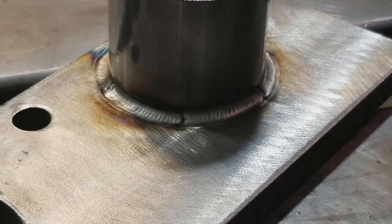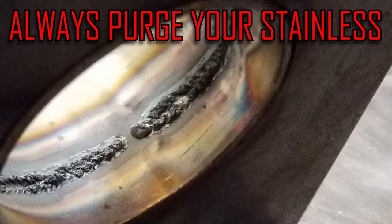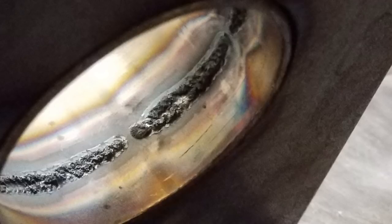This is stainless steel and I'll be perfectly honest — there's a reason I did not purge this, and it's because you can actually see the result. If you do not purge something like this, it looks absolutely terrible and it will happily snap right off because it is extremely weak. The only point where I didn't get full penetration is at my stop and starts, circled here in red. The rest was a good continuous bead all the way through — except for not purging. Make sure you purge. If it was properly purged, this will hold and it's good to go.